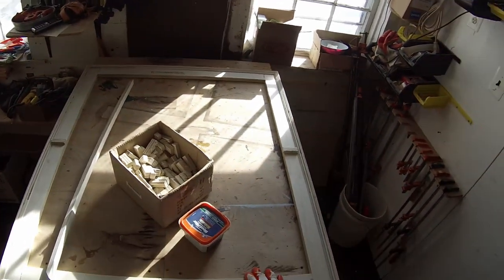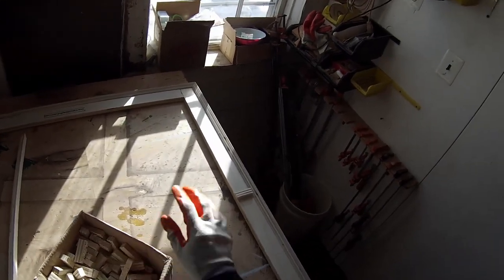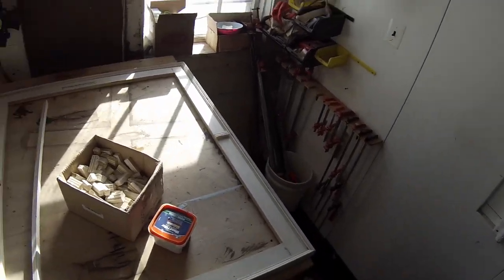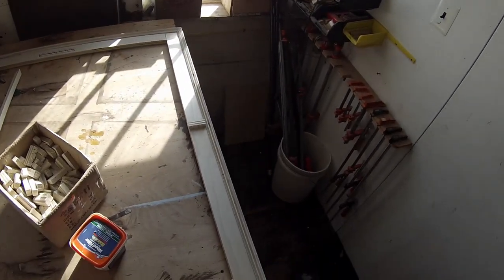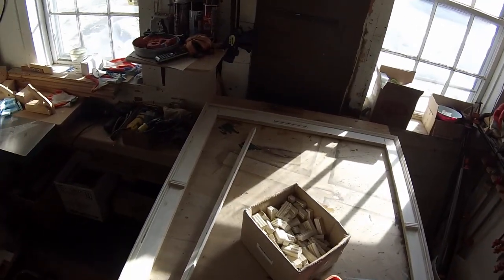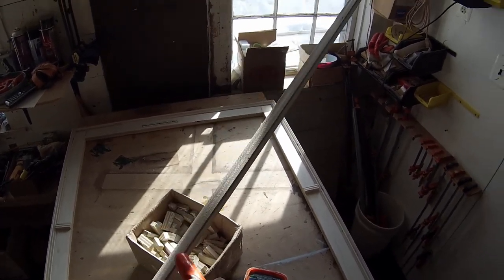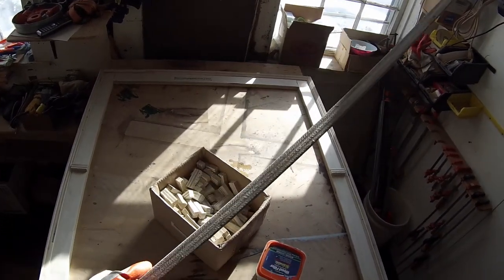And this is my wrapping station. So when I finish the frame, I stack 5 at a time. And then use these little spacer blocks to pad it out so that the plastic wrap doesn't compress it together. Because I actually had a problem with that before. The compression would put stress on these joints and could warp the frame a little bit, because this glue joint takes a while to set up. Because sometimes the plywood has defects in the veneering, I have to fill this on the edge, because when the canvas wraps around that, that'll make a little wrinkle there. So I just fill that with some filler.